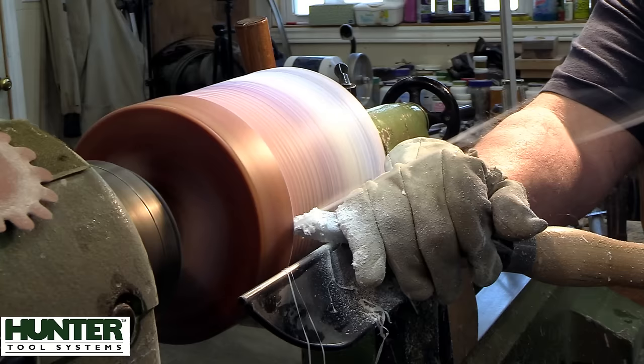I am always kind of concerned about using different brands of resins. I wish that Designer Epoxy would come out with a stabilizing resin. That way we know for sure that things are going to be compatible. But I know that typically when you're talking finishes, if I'm doing an epoxy coat, I don't want to put a sanding sealer underneath of it or anything like that. I want that epoxy coat to stick to the wood. And of course, a lot of times the issue with doing epoxy coats is air leaching out of the wood and causing bubbles in your epoxy coat. So, I know that it's a common practice to seal the wood prior to putting an epoxy coat finish on, but I'm always worried if things are compatible with each other. And this is a very big problem when it comes to finishes, because some finishes you can put over top of others and some you can't.